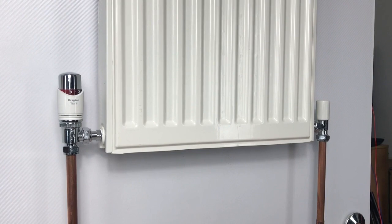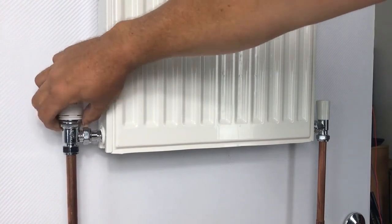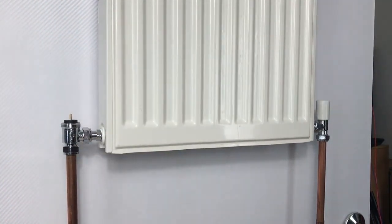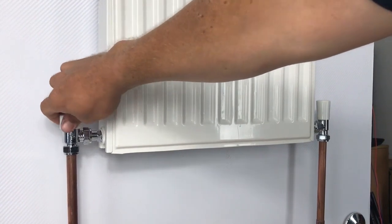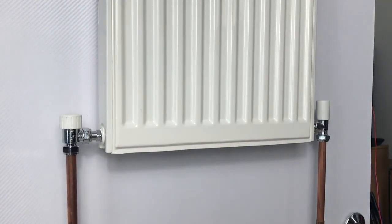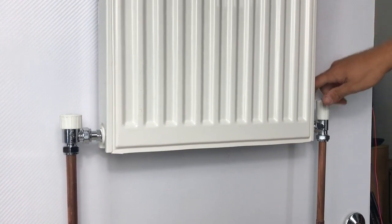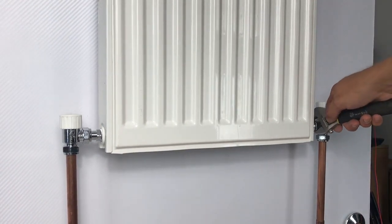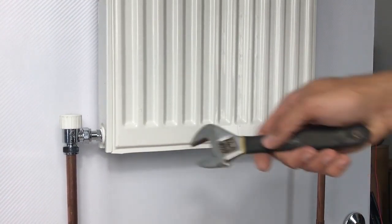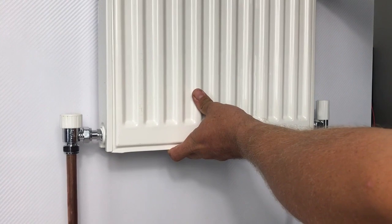The benefit of balancing in this fashion is that the balance is locked into the valve body. Should you want to remove the radiator for decorating, take the sensing head off and replace it with the decorator cap — remember, the decorator cap isn't just to protect the threads, it also shuts off that leg of the radiator. This doesn't change any of the balancing. On the lock shield side, remove the locking cap, fit the adjusting cap, throttle it down, then loosen the nuts on the tail pieces to allow the radiator to be lifted off its bracket.